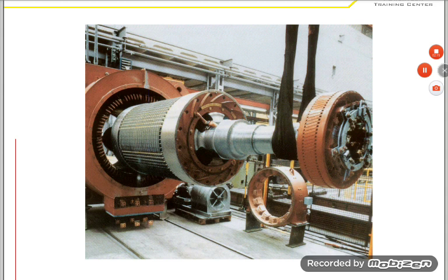Your brushes are looking like this. Here you can see one brush — this is a casing, and here's a carbon brush which is put into the casing. It looks a little bit outside of the casing. The carbon brush is a little bit longer than the casing, and this surface comes then in contact with the slip ring. There you can put your direct current for the excitation.